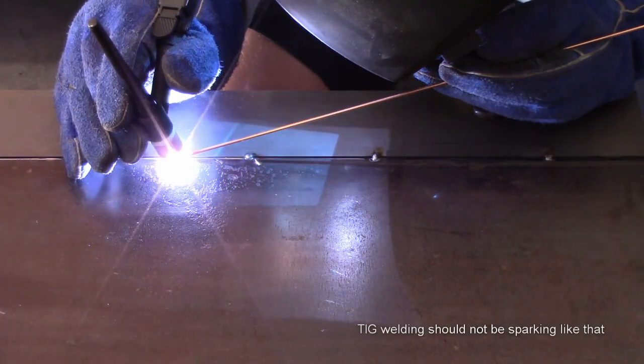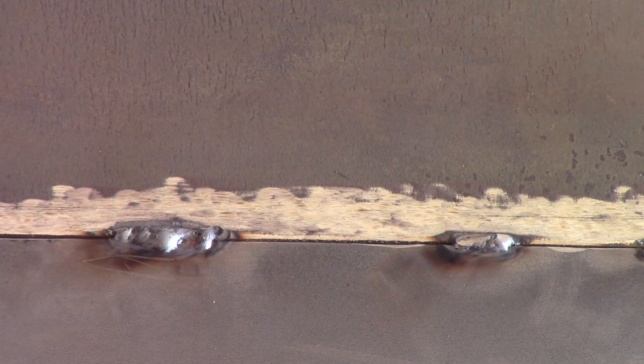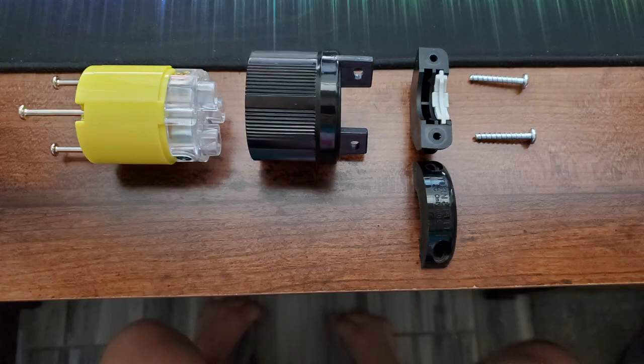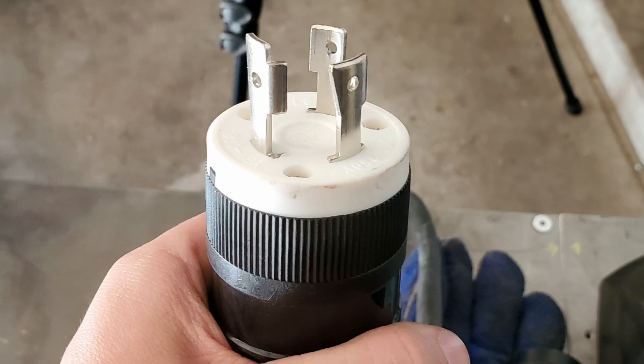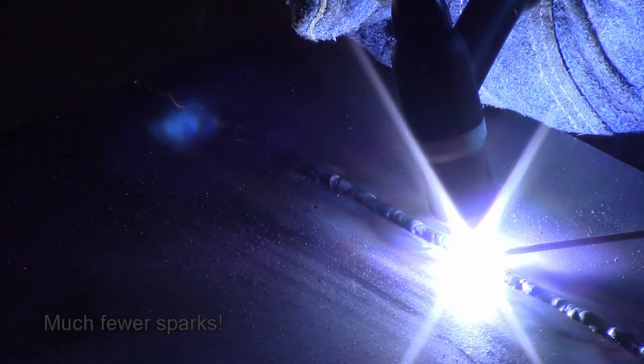Welding on the extension didn't go as planned. Penetration was poor and I kept seeing contamination in the weld. Turned out I needed to clean the tabletop better and use 240 instead of 120 AC. I just can't dry clothes and weld at the same time now. With the penetration and contamination issues fixed, the extension welding went swimmingly.